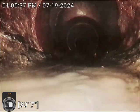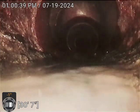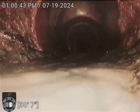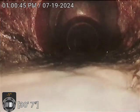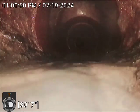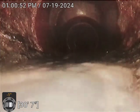Hey, this is the end of the line with the cast iron pipe. You're at this point right here. We're at the combo junction, which is where there's a transition from the cast iron to the clay. As you can see, the top there is the opening where there used to be a test tee cleanout